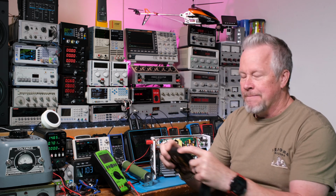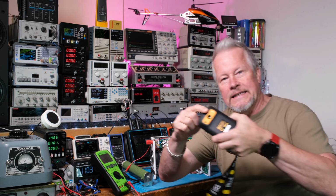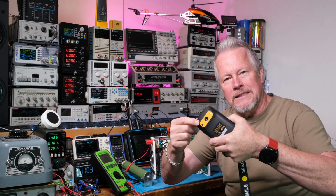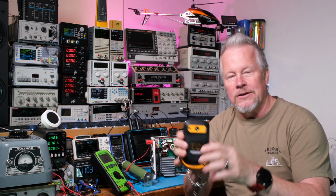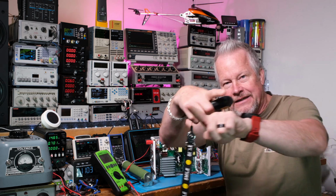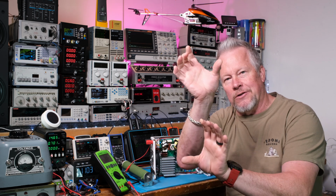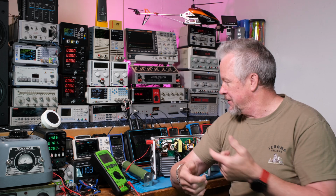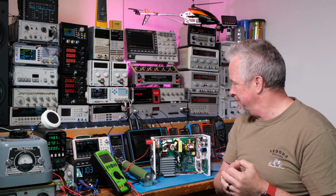It has a camera right there, but the new one, like I say, has high resolution. Unlike one like this where you have a regular light spectrum camera with the thermal, and you can overlay them on top of each other, there's some parallax error, right? Because the lenses are aimed this way, you have to adjust the two images to line them up this way and this way. So it's much nicer and easier just to have a camera that you can move around. Anyway, let's come over here and take a look, and I'll show you what I'm talking about.